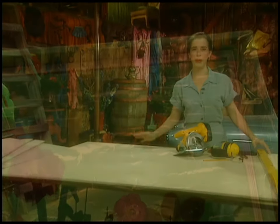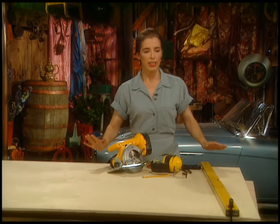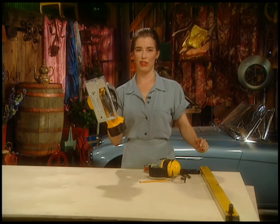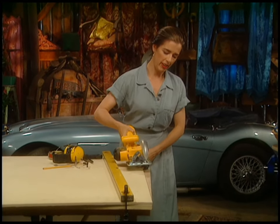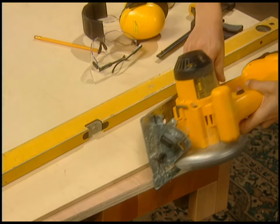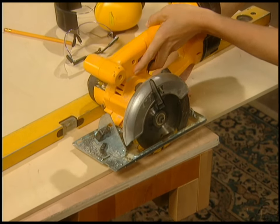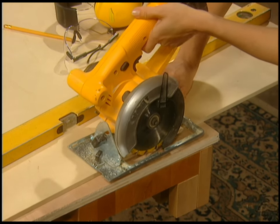You come home with your giant piece of shop birch plywood — it's got a birch surface, but if you don't have a table saw and can't get really nice straight cuts, a circular saw works. Put the saw on the edge of the wood you want to cut, remove the safety guard briefly, and use the adjustment on the base plate. Set the blade exactly deep enough to just cut through the plywood, but no deeper.